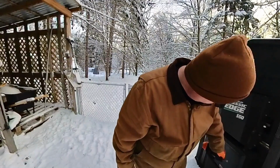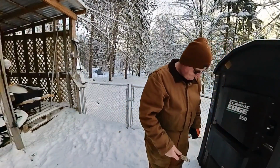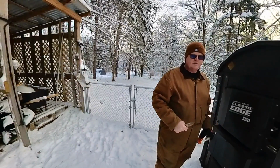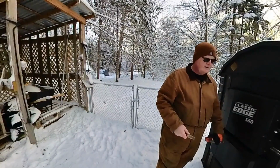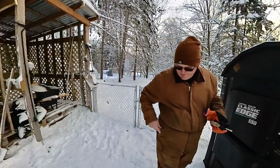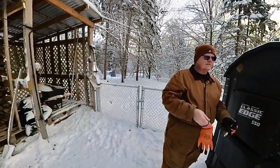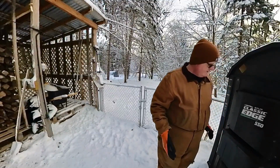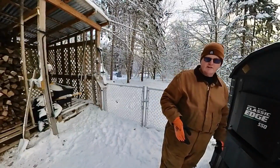There are two little screws underneath this big box that we've got to take out. That lifts the box off, and then you just open the door on the blower chamber, and then you need the bigger nut driver, because there's a hose clamp that holds the solenoid and primary tube onto the boiler itself. So you'll need to pull that off. I'm going to change camera angle here, and we'll go ahead and get started.